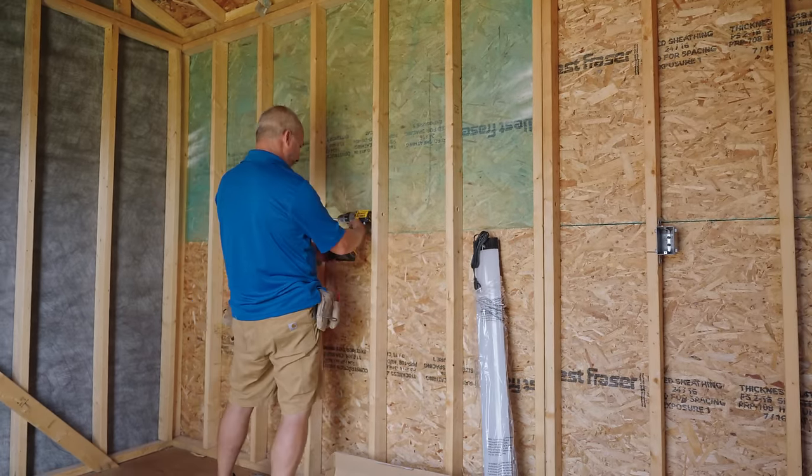Now, we're compressed. So I've got a ground wire and a white and a black. Like I said, in this situation, we're making it a switch leg. So this is how the switch goes in. It has a little sign on it, Leviton. It says top. It makes it as easy as it can. So the black is gonna go to the bottom. And then when you flick the switch, it sends the power back out the other wire, back up to the light, to empower the light.